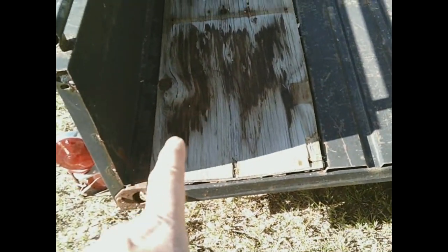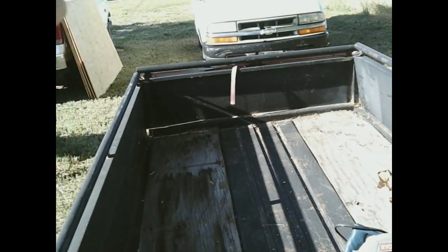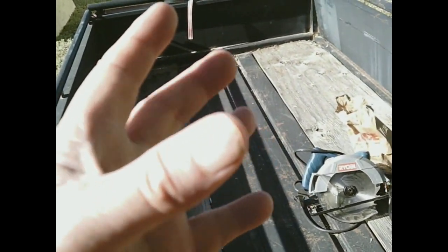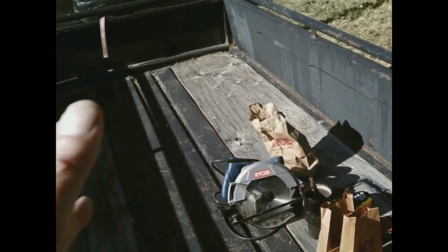I'm going to be doing my floor framing a little bit differently in that I'm going to run the joists lengthwise, which I'll explain in a minute. I'm also going to make it just a little bit shorter than eight feet in length, because I'm going to use eight-foot panels on the roof. In the plans I put in nine-foot panels so you could go the full eight-foot length, but it will save me a little bit of money if I only use the eight-foot panels, and I don't care about a large overhang on the front. So if you want to modify that in your plans, you can.